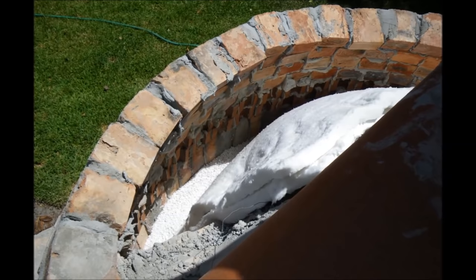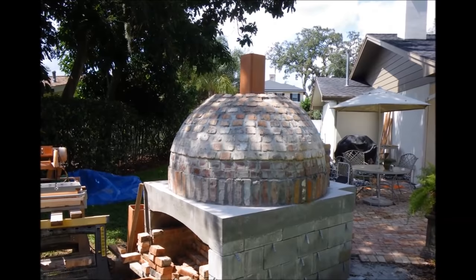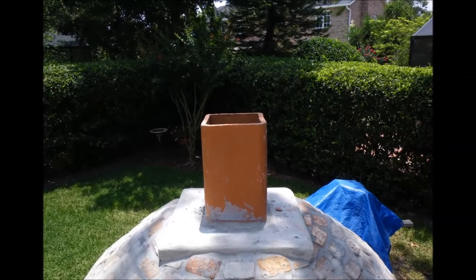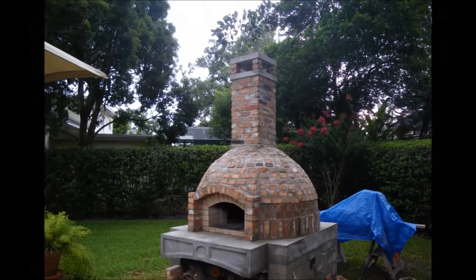The bat insulation is a great solution if you're tight on space because inch per inch on thickness it's a lot more efficient than perlite. But since I didn't have much of a space constraint, I wrapped the inner dome with bats and filled the rest of the space up with loose perlite. Towards the top of the oven I went back to perlite concrete to give me a little strength and cohesiveness to the insulation at the top of the dome. Then I precast a concrete plate to help support the outer brick of the chimney, put that in place, ran the brick up, and precast a couple of other pieces to finish out the top and protect the chimney from rain. That last top piece was a nightmare getting on top of the chimney. At this point I had a fully functional oven, and in the construction business we have a tradition when a building is topped out — we have a topping out party. So I made my first pizza and it wasn't too bad for the first one.